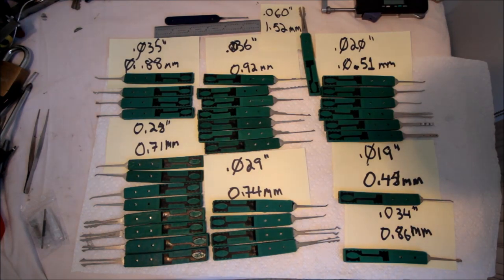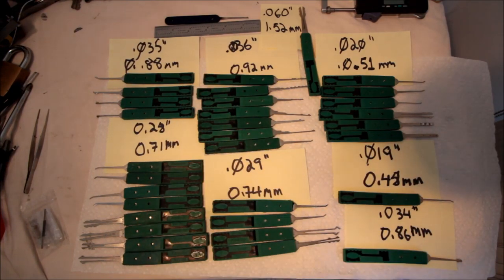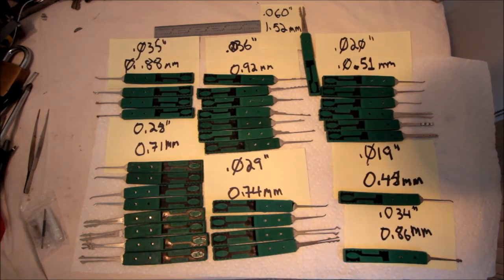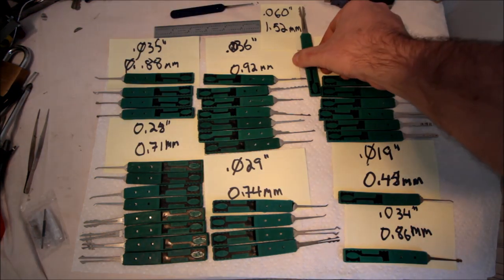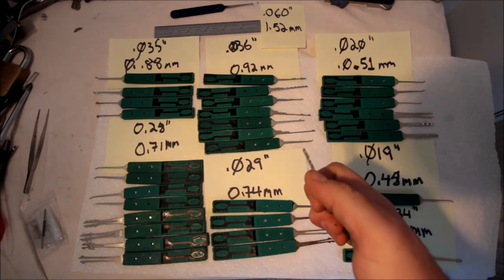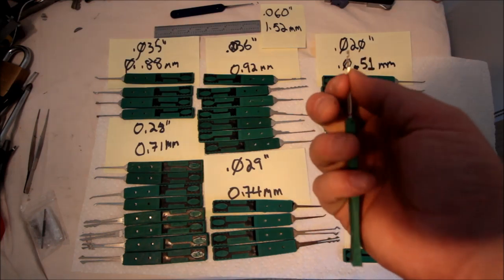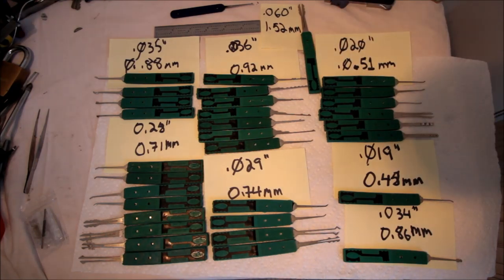You've got at least three primary thicknesses here. Where the 2.8, oh yeah, there's the 2.8. All of those. So pretty standard thicknesses, I'd say. This is my Peterson diamond, which has been sanded slightly, but I'll measure it down at the base, and that's 0.025. The one exception is this goofy thing, which is double. It's not going to focus for me with this lens, but you can see there's two blades. You can hear it. Total thickness on that is 0.060, so the metal's probably 0.030.